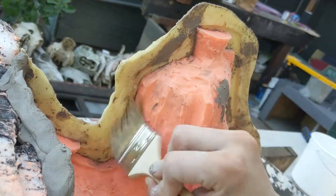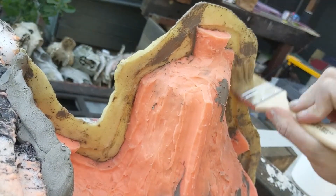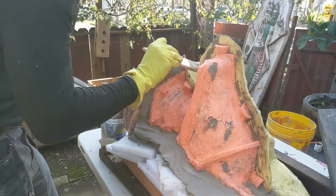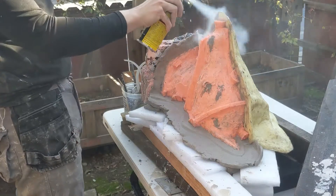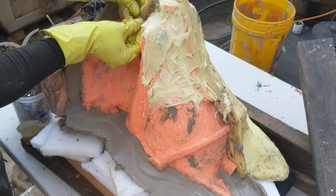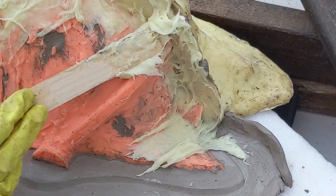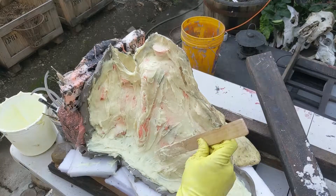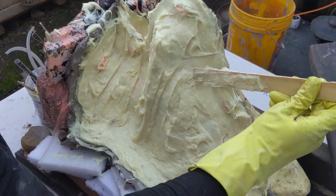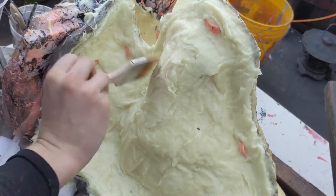So I don't get any unwanted mechanical locking problems, I'm going to fill in any holes along the seam of my first paste shell with clay. This happened because I put the first layer on too thick all at once — I'll be sure not to do that next time. Now, since I have one side of the mold done, I'm going to seal that edge by brushing on a few layers of Sonite wax. The epoxy paste is pretty porous along the edge, so to ensure I have absolutely no mechanical locking, this wax fills all the microscopic holes. You could also line the edge with aluminum foil and apply Sonite wax, but just the Sonite wax alone should do fine with some spray-on mold release. I'm also going to add some wedges of clay on the edge so I can pry it open with a screwdriver when it's all solid.